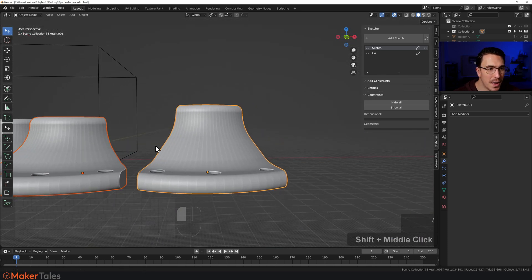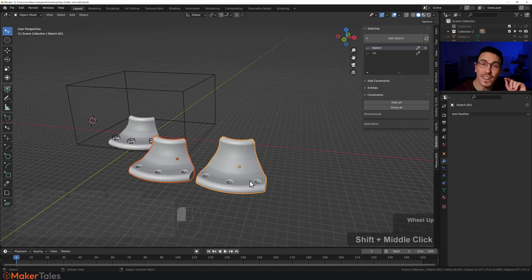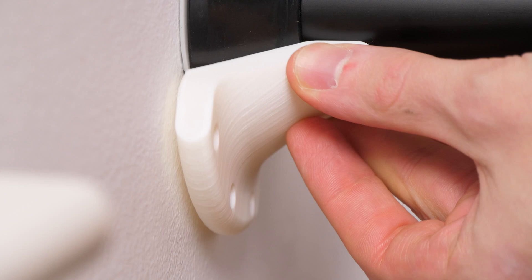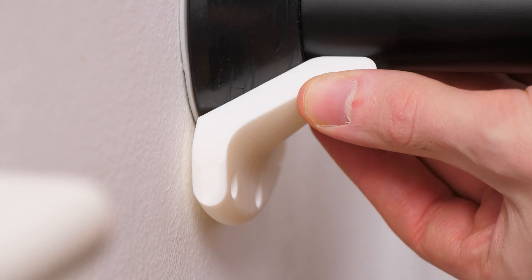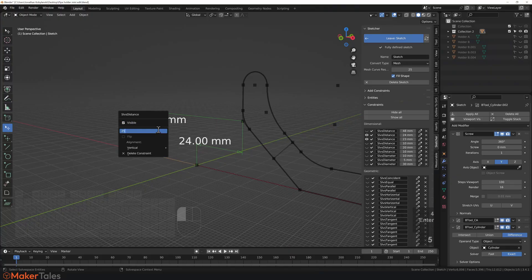With those created, I used the same parametric design approach to make two new ones. You'll see they're both different — one is slightly higher, one slightly shorter, and the actual socket area differs between them. Once I got these printed, lo and behold, there was a problem. This is why we use parametric design: very quick iterative changes. The little foot had just a bit extra I hadn't accounted for, so my mount was about three millimeters off. A quick and easy change — I went back in, made everything a little bigger, and got it reprinted.